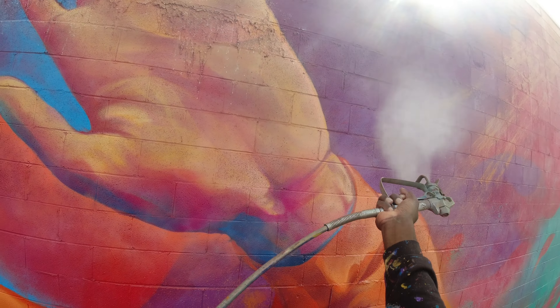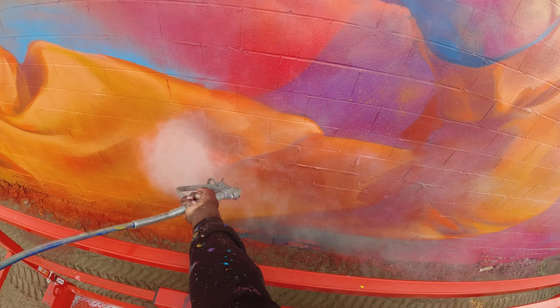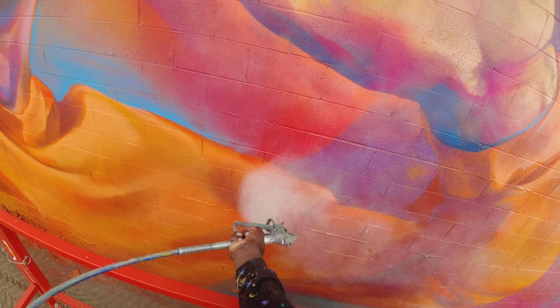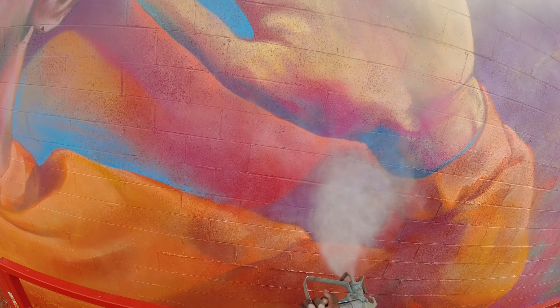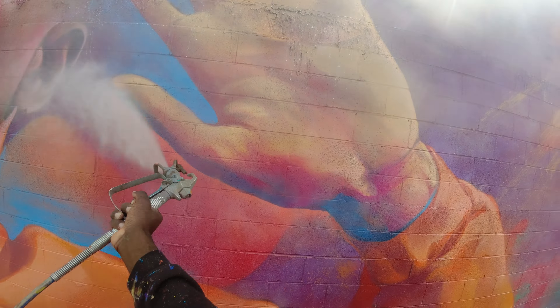Because when it runs down the wall, it's really annoying. Although this anti-graffiti coating dries to a clear transparent coat, when you have a lot of it in one area, it does sort of build up and you can see those streaks. So that's why when it does build up, I use my roller and just try to roll it out as much as I can.